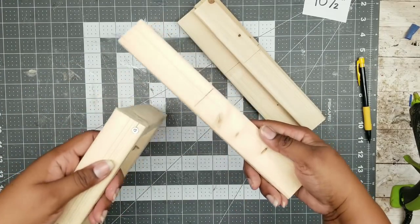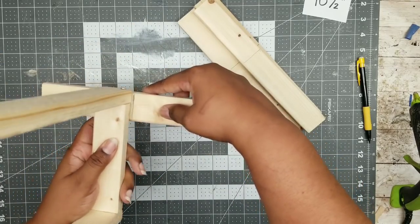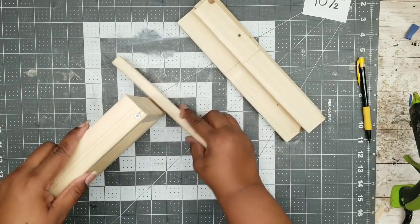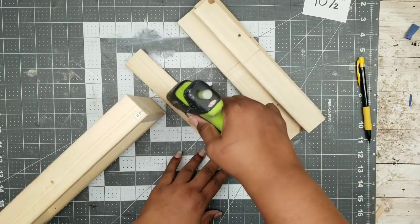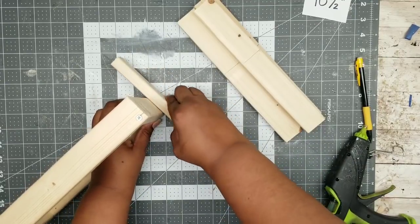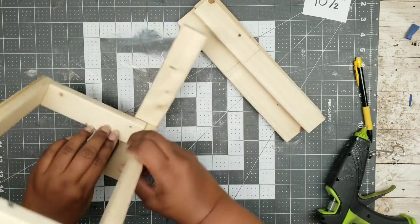So we're going to start to apply our legs to the outside of the box, and using that line that we marked will be the bottom of the seat box as shown here. Now to secure these temporarily, we are using our wood stick hot glue, and we're just going to apply some and adhere it to the outside of the box at each one of those 4 corners.